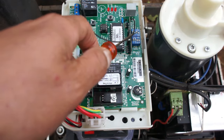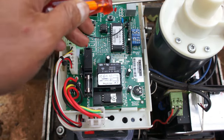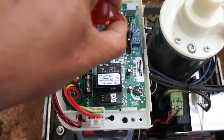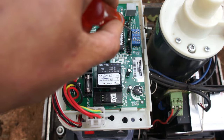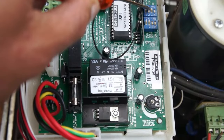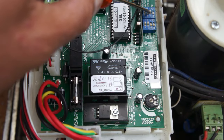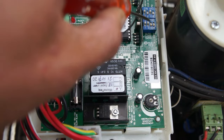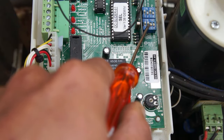These are the trigger switches you'll need in order to program the gate. The most important one is this one here — it allows you to set it as a townhouse mode. When you have this on, the gate will only stop when there's an obstruction in the way. Number three is the direction of the gate: when this is up, the gate closes to the left; when it's down, it closes to the right.